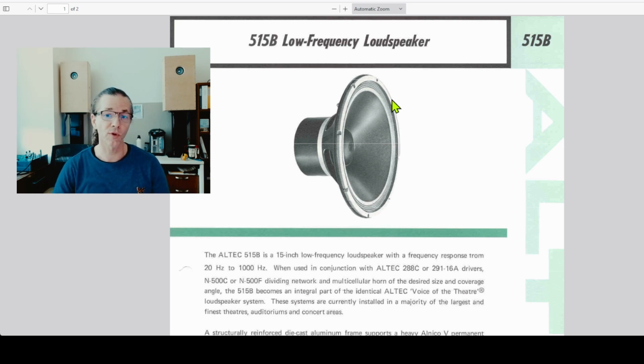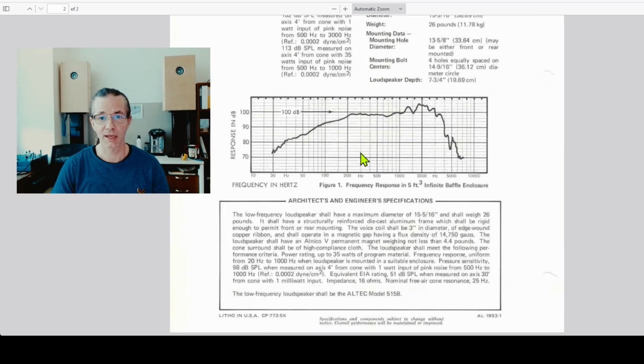And that's true for most woofers. Every woofer that's like 16 inches or so will get stronger and stronger in the output up to about 2 kilohertz. So if we don't limit them at a kilohertz or 500 hertz, 200 hertz, whatever, they will start climbing. Most of them not as strong as the Altec drivers, but we still will see a steady slope of rising, usually up to 2 kilohertz, and then they will fall off.